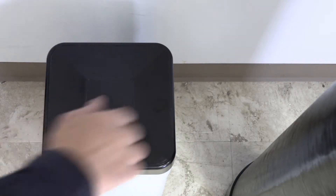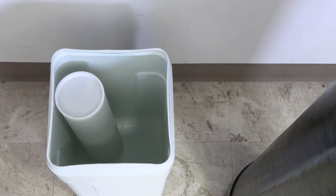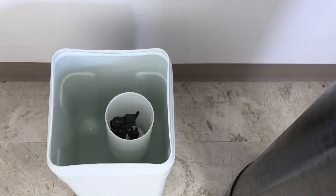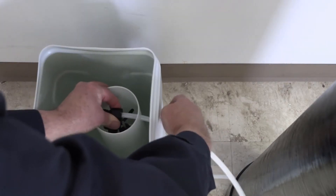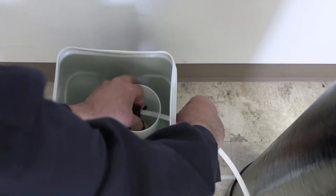The first thing we'll do is go ahead and hook up to the hydrogen peroxide tank. Basically you have your float assembly here. We're going to go ahead and feed the tube through here, loosen this compression fitting up — you can feel it — slide it until it stops, and then this will be hand tightened.